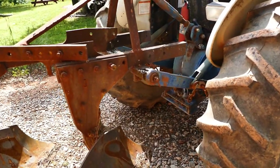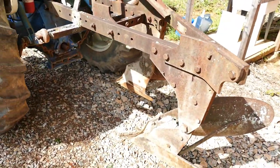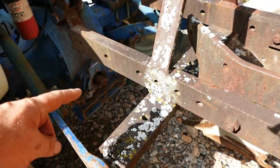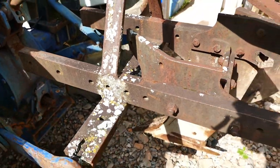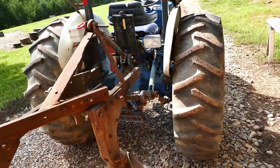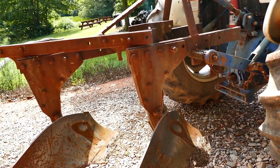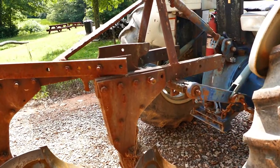There is the old plow that we picked up earlier in the season. It was like $175. It's a homemade thing that looks like it was an old, I don't know, different type of attachment, like for an old 8N tractor or something. Somebody welded this drawbar to it so it can mount to a regular three-point hitch. And anyway, it's a two-bottom plow. This 50-horsepower tractor, as long as it has traction, has no trouble pulling this plow. And the other tractor, my Kubota, struggles a bit at times just because it's not nearly as heavy. So I'm going to do the plowing with this tractor, and then I'm going to do the spreading and the tilling with the other tractor.